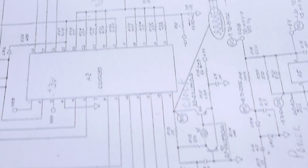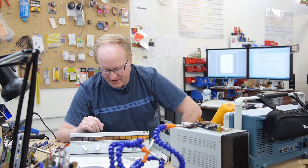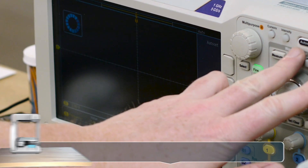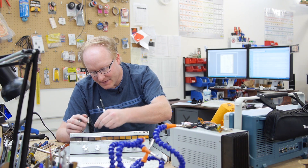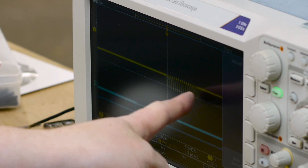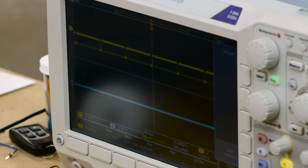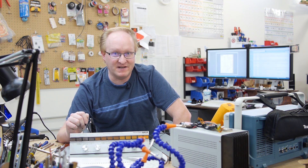I have a schematic sheet — it's a little hard to read, but there are waveforms indicated on it. Clock is supposed to be here — that's good. There are two square waves created by the op amps that represent the music. Over here there are two crossover points. This low here and these pulses represent an NTSC horizontal sync and color burst. The frequency of the square wave is 15.7 kHz — that is an NTSC horizontal television signal. So the chip is definitely outputting a video signal; that's why we saw black on the screen, but something else is preventing it from showing the shapes.